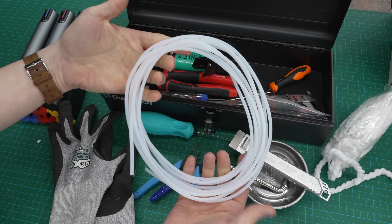Speaking of maintenance and troubleshooting, I always think of the Boy Scout motto — be prepared — when addressing this next mistake. It always finds a way to happen at the worst possible time. Something that recently happened to me: I was running a late-night print on my X1 Carbon for a friend. It had to be finished by the morning, but before I headed to bed I went down to check on it and saw the printer was paused with a filament error. When I looked closer, I realized the PTFE tube had worn through and the filament was pushing out the side instead of into the hotend. I didn't have enough time to start it on another printer, and without a fix that print would not have been done on time. But thankfully, I had my maintenance kit right there. I clipped the filament, swapped in a new PTFE tube, hit resume on the printer, and it picked up right where it left off.